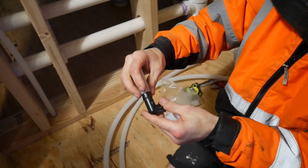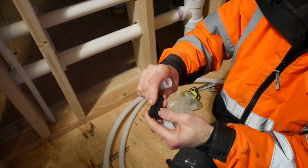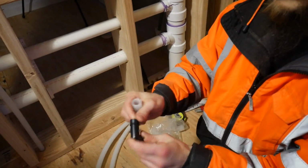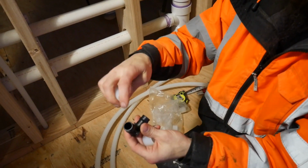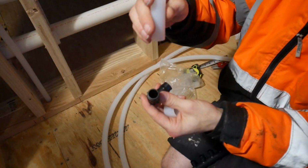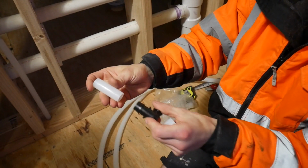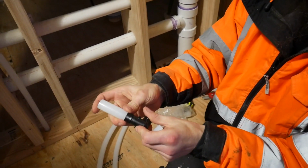tight without any clamps and any chance of leaking. It's basically leak proof. It's really awesome. And the other cool thing about this type of PEX is you can see the fittings are full flow, so they don't restrict the flow. Most PEX at the store, the fittings are smaller, so they can slide into the pipe, and then you clamp the pipe down on it.